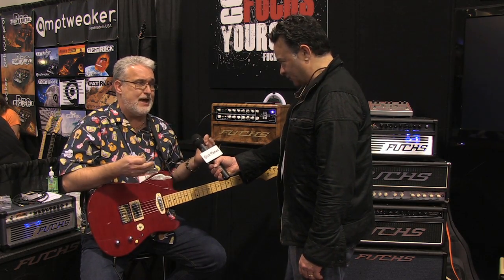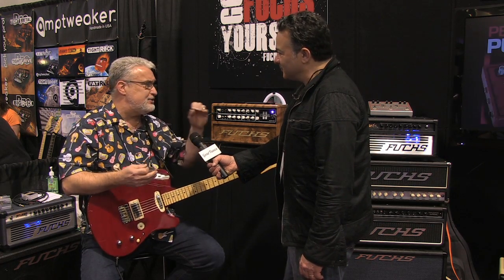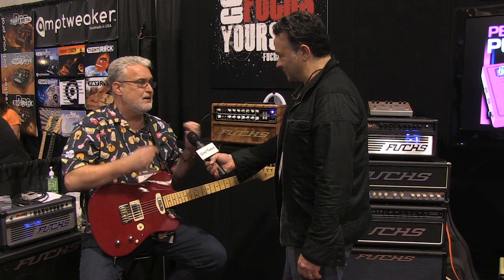Channel 1 is a clean channel that can be driven slightly dirty. Channel 2 is an over-the-top gain channel, very much like the original ODS with a few refinements. It has a killer 16-bit digital reverb in it, 2 effects loops, a global master volume and presence control, and will be available in 50 and 100 watt versions, in heads or combos.